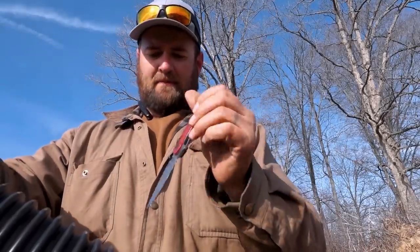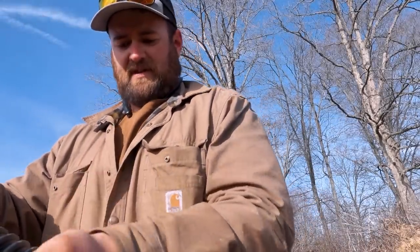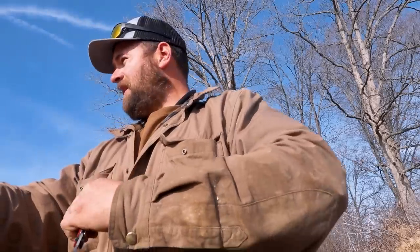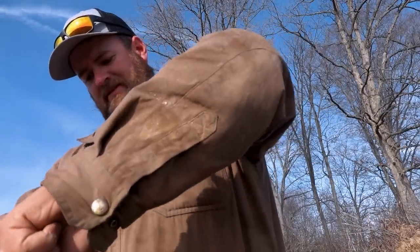Abandoning this line, I'm going to cut a small section of this pipe, about a foot, and put a cap on it. That way we don't fill our main up with dirt or backflow water into this low spot. Like I say, it sucks that we're having to abandon this line, but I'd much rather abandon this much of it than 2,000 feet of it. I don't think we'd even gone 200 feet yet. And if that's the worst that we screw up, so be it.